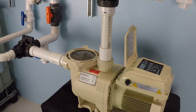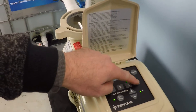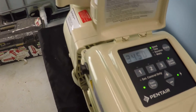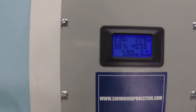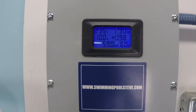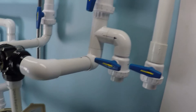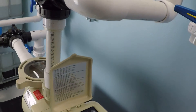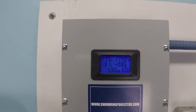For a lot less money than running the pump on full speed. Take a look here as we ramp up to the full speed value. At 2.25 kilowatts — that was a lot more power versus the 370-some-odd watts that we're consuming when the pump is running at half speed.